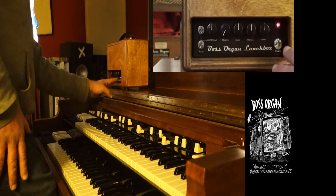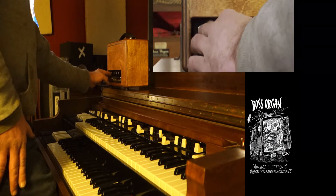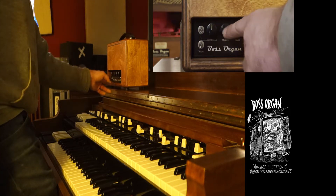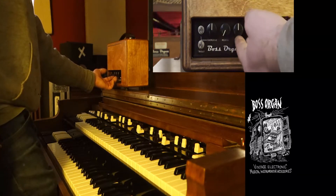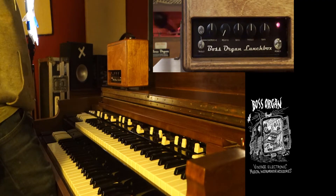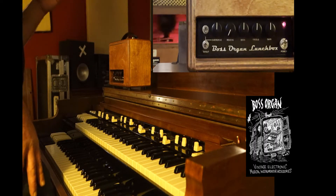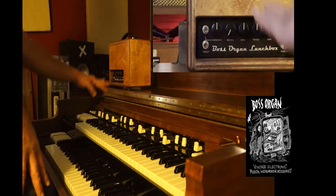The rest of the features are all in-line in terms of circuit order. Overdrive comes first, which you can turn on or off. The overdrive feature adds another gain stage into the circuit to really push things into overdrive. Next in the circuit is reverb — this is a tube-driven spring reverb in this box. Next you have EQ: bass and treble controls, and then lastly a gain control, which is essentially a master volume for the preamp in the organ. The bass, treble, and gain controls are all cut or boost, so straight up and down yields a flat response and you can boost or cut from there.